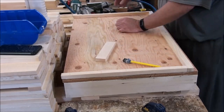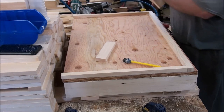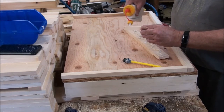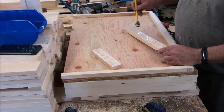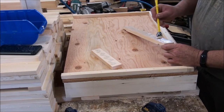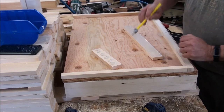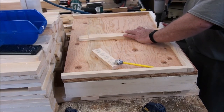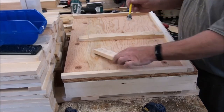I'm going to need a front. Put the glue on both of them, spread the glue on this one. I have been using plenty of glue — I could get away with less, but it's actually a little faster to spread the glue when there's more of it, you don't have to chase it around as much. Now this is a change — I'll just tack this. No reason for a big staple here, there's going to be two giant screws in that. Just tack it and that'll allow me to go ahead and put this one on.